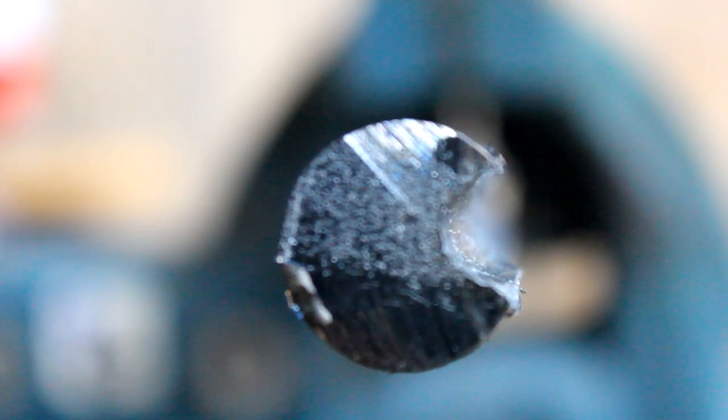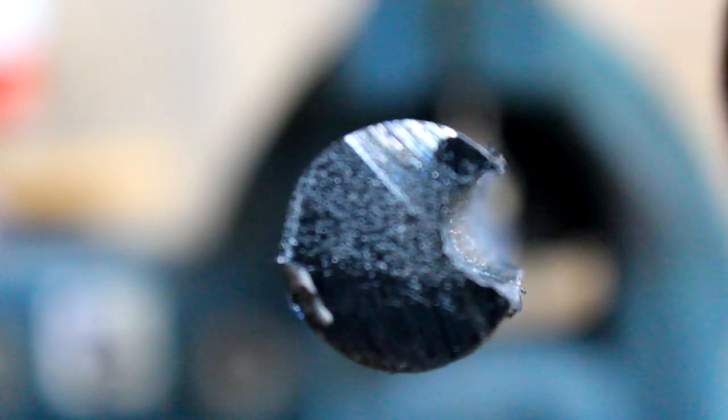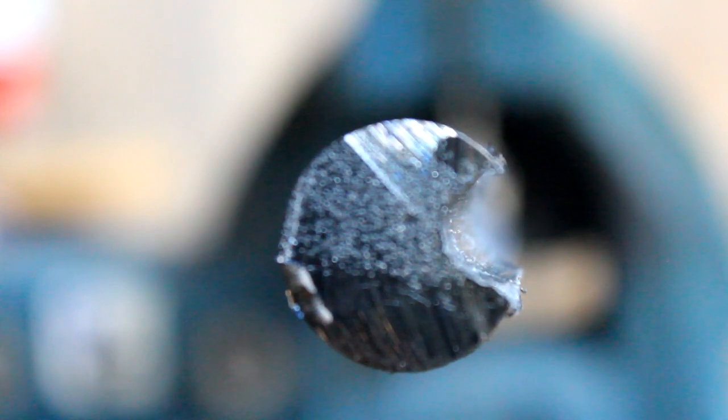Here is the current shape we're at - as you can see it is kind of sliding upwards, which is okay, that's expected to happen right off the bat. You just kind of have to work the grinding disc back down to get your actual little area for all the shavings and stuff to come out. Then we'll end up working on the bevel around the outside, but as you can see it's just a slow process with lots of sparks.